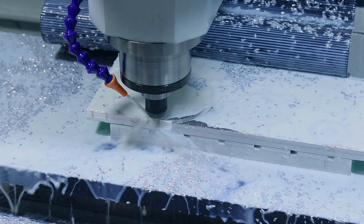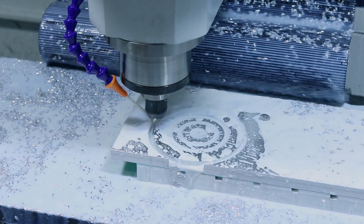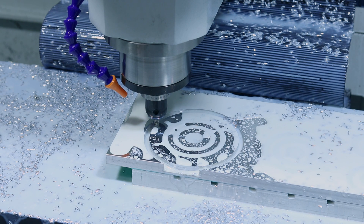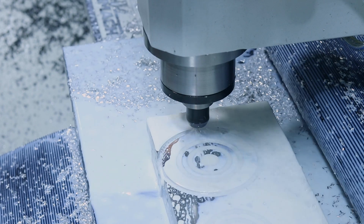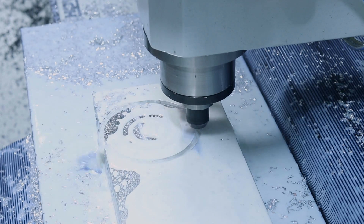I was trying to give you guys a better view and keep some of that flood coolant out of the way, and that's all it took to get the chain reaction of melty aluminum started — those flutes loaded right up and started to bog down the spindle. Luckily I stopped it in time and was able to clean the flutes out and keep going. But it really goes to show just how important constant coolant flow is when slotting in aluminum.